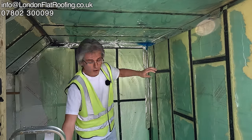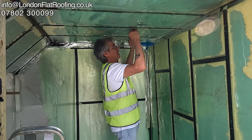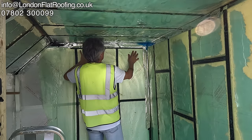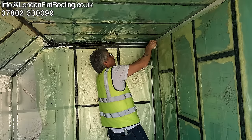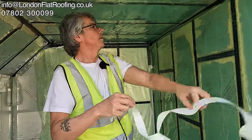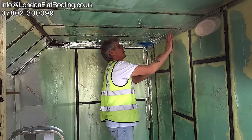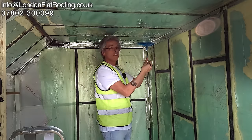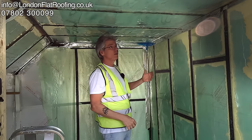When I got to the junction I did it in three pieces. I did this piece first, came down the wall and taped it to the wall. I then did this piece up, and then overlaid this one — but when I overlaid it I put more tape in. You should be able to see here: I'm putting a second layer of butyl tape up there so that when I put this piece over the top, I've got a double layer. They're both sealed together — the vapor barriers themselves are sealed together.